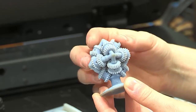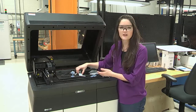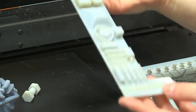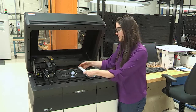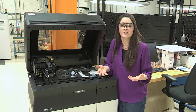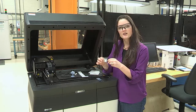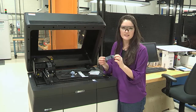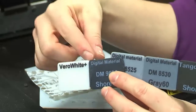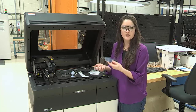The great thing about inkjet is that you get really, really high resolution — like 30 microns, 16 microns resolution. The layer resolution on this machine is 17 microns, so you can't really even see the layers anymore. Really high resolution, really great surface finish, really great feature sizes. Another great thing about inkjet is that you can do multiple materials, just like you can do multiple colors on your inkjet printer at home. We have this stiff white plastic and this rubbery black plastic, and we can mix them to get the shades of gray in between. So we can actually tailor the durometer of our parts throughout the part — really interesting process.